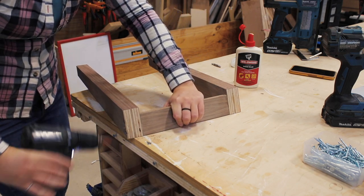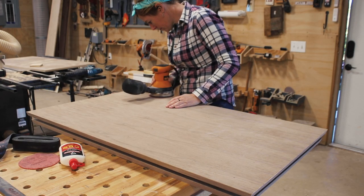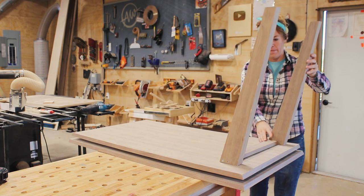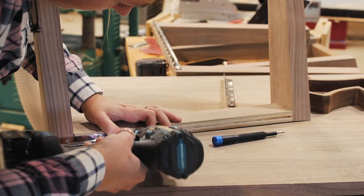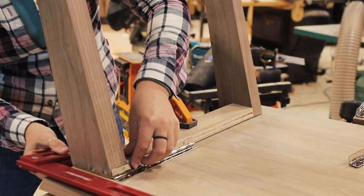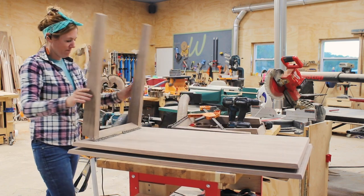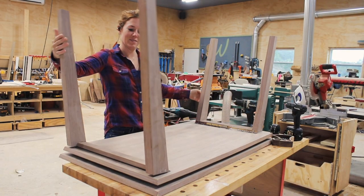I ended up changing the design slightly to make the end product more stable — you'll see what I mean in just a few minutes. For now let's attach the legs. The plan is that each set will be slightly offset from the corresponding set. The tall set will be placed on the outside and the short set on the inside. I'm using a strip of piano hinge on each leg to create the pivot point. I started by attaching the hinge to the legs first, making sure the leg and the hinge were flat on any surface. After getting those screws set I took my time to line up my legs then attach the hinge to the top. Since these small screws are so easy to strip, I always use a hand driver to thread them in instead of a drill. After getting the first in, I repeated with the remaining three, working from the outside legs inward. It's important to take your time here and attach these square or they won't fold up properly in the end.